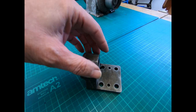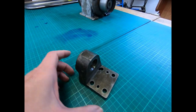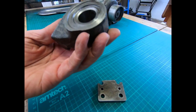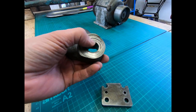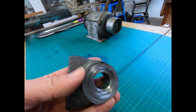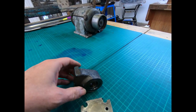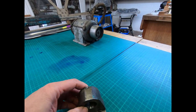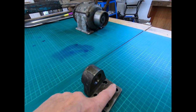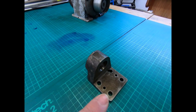Especially as I can't weld myself, that would require someone else. In the simplest terms, it is a block with a hole and a couple of indents - so that's basically a turning exercise. I can hold it in a four-jaw and bore the hole - that'd be fine - and then mill it. It'd be nice to get a good surface finish, only if I had the surface grinder - but anyway, chicken and egg stuff there.